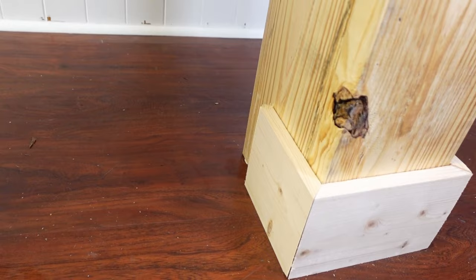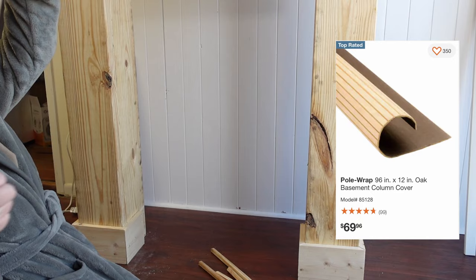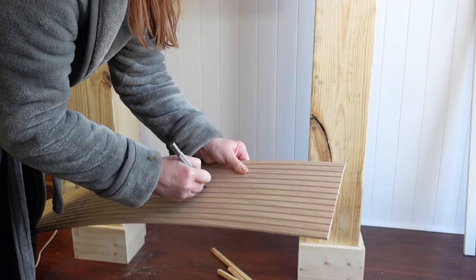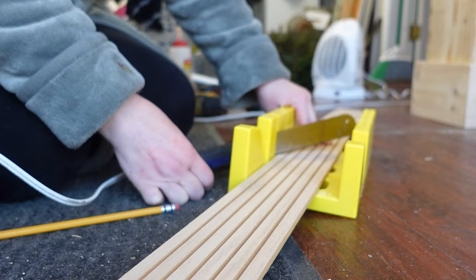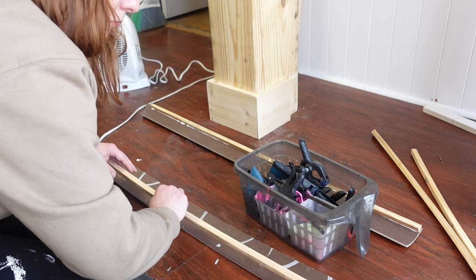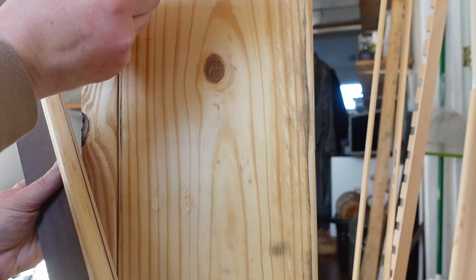The inside piece is shorter than the leg because I'm adding a decorative insert — I'm using pole wrap for that inside detail. It's a little more expensive but I've gotten a lot of use out of it. It's super easy to cut; all you need is a utility knife or exacto knife to cut between the slats — it cuts just like butter. A miter box will work to cut down the length, but my handsaw wasn't long enough for the 45-degree angle so I used the big saw. Since the pole wrap is so thin I can't attach it directly, so I glued a thin piece of scrap wood to the back to have more surface area to glue and brad nail it onto the legs.